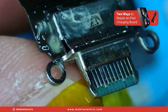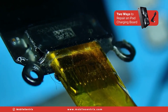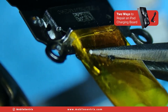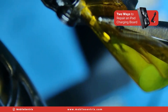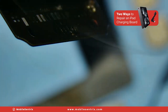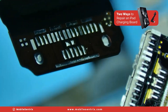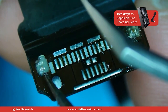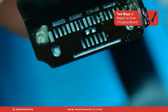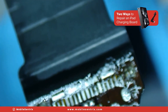I'm going to take a little bit of Kapton tape and tape that off just so it doesn't melt — even if it melts a little it's okay. Now I'm going to take my hot air gun. Looking at it on the underside it was clean, which means I'm going to be able to put this back together. These little guys came off and they're not sticking anymore, so I'll have to adjust for that. In the meantime, what I'm going to do is wick the through holes here.